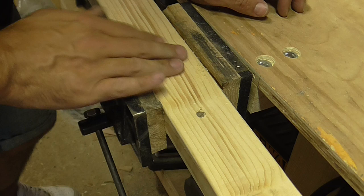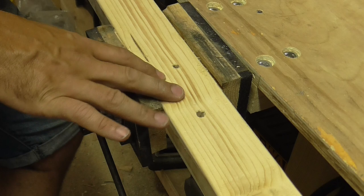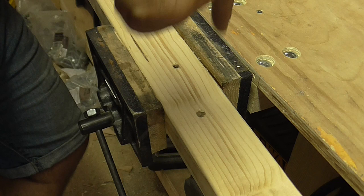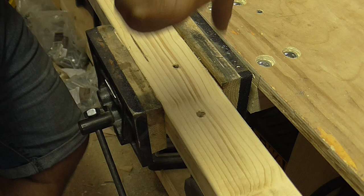So that seemed to drill quite well through the wood as well — probably not as easy as a specific wood bit, but nonetheless I'm quite surprised with how well that's coped. If you're placing something directly on masonry and want to drill through the wood and into the masonry to get it all lined up properly, I'd say this would be perfect.